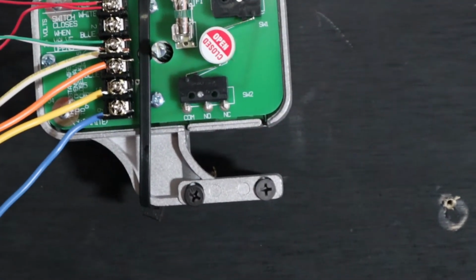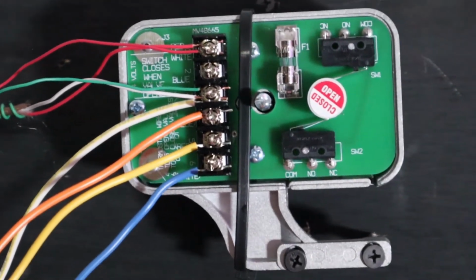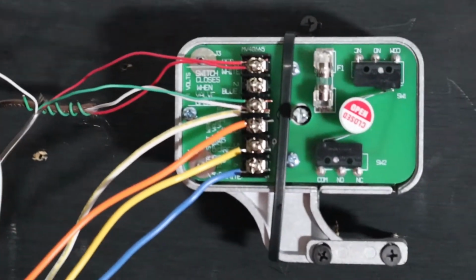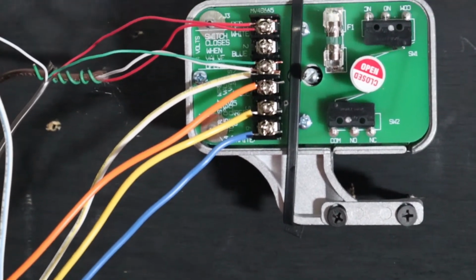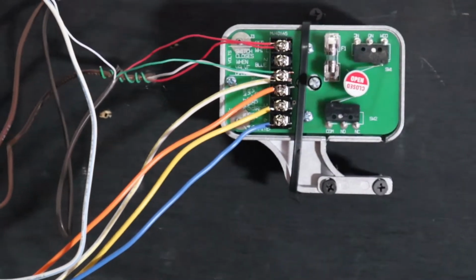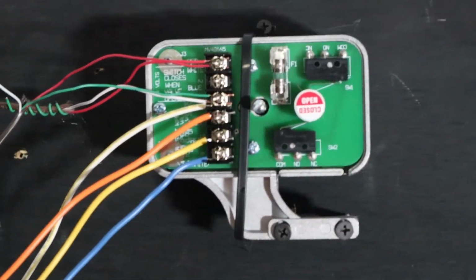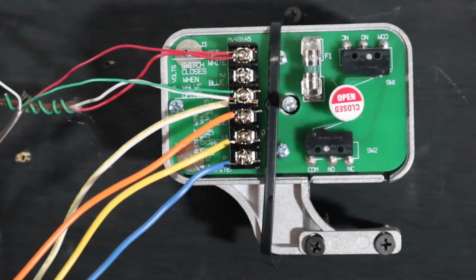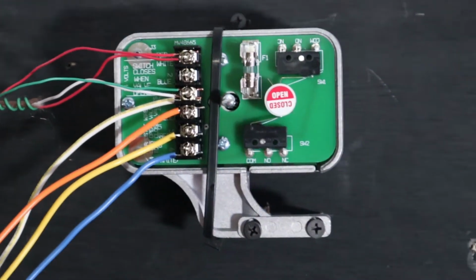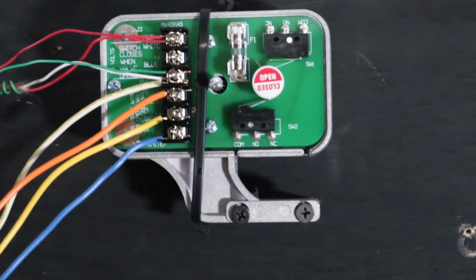Is it still spinning? It looks like it's really slow. So right now, when you see the relay energized, if you wired it correctly, it would be opening your valve, and you would get hot water from whatever pump is wired. It's going to be circulating through the valve and heating your space. So it's open. It should stay there. It's going to be circulating hot water from the boiler to your space, baseboard, radiators, whatever you have, and then it's going to come back to the boiler through the return.